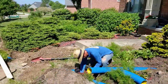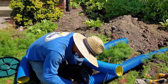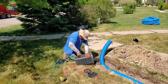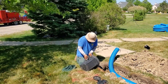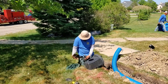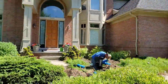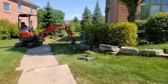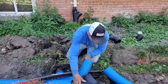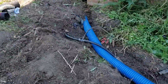Look how far away from the house it is. Did you see all the landscape that's in the way? That dams water — that was also happening. The homeowner said their front walkway is always flooded after a rain. It's because the water can't find its way out of there. After years and years of bark mulch decomposing, you end up with organic material and good topsoil in the beds, but it does block the flow of surface water. Sometimes you have to go into these older landscape beds and take out some of that decomposed bark material to get your bed back to where it'll let the water drain off the walkway.